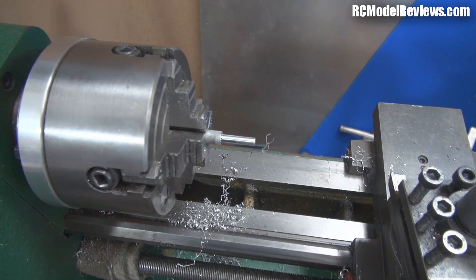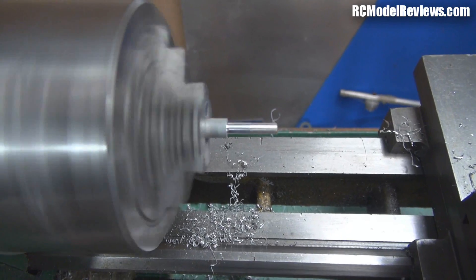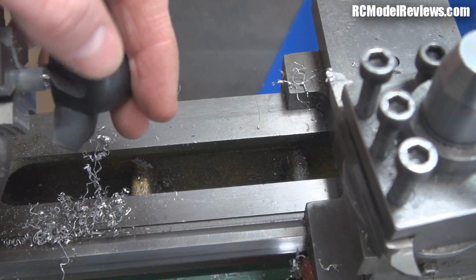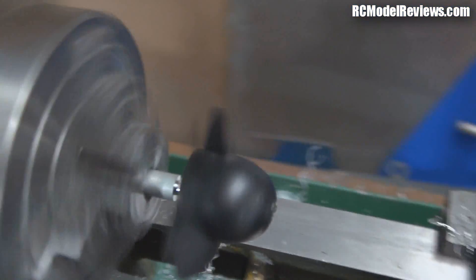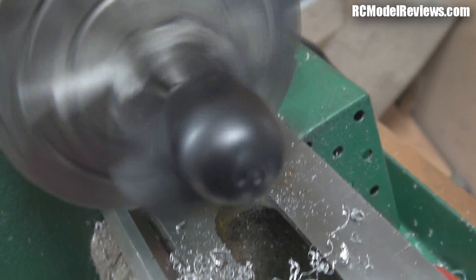What I'm going to do is put the 70mm fan on that plane and maiden it again, but not right now because there's no one else here but me. Here's the video showing you what I found when I put the impeller on the lathe and tried to true it up. I'm on the internal mic so the audio might be a bit different. I've just turned up this little shaft which I want to slip the impeller onto. If I turn this on, you can see it spins perfectly concentrically — perfectly straight, which is what you get when you turn something up on a lathe. It's a very nice fit inside the impeller. Let's slide the impeller on — no movement, not sloppy at all. Let's turn the lathe on and have a look.